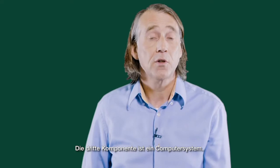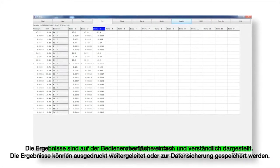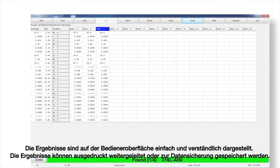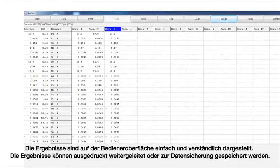The intensity measured is proportional to the concentration of the element in the sample. The third component is the computer system. The computer system acquires the measured intensities and processes this data via a predefined calibration to produce elemental concentrations. The user interface ensures minimal operator intervention, with results clearly displayed, which can be printed or stored for future reference.